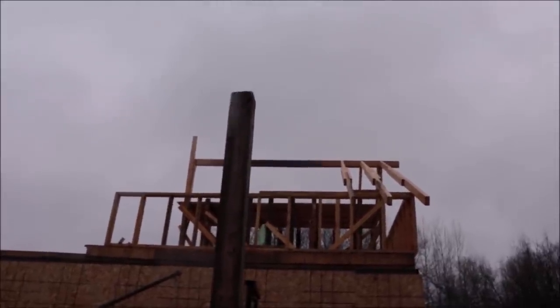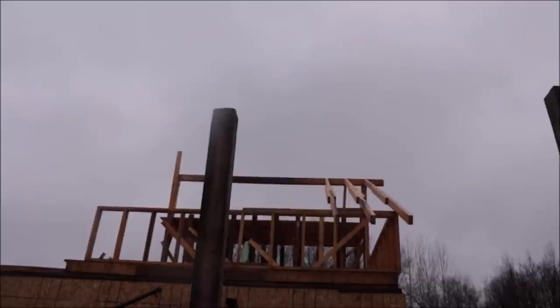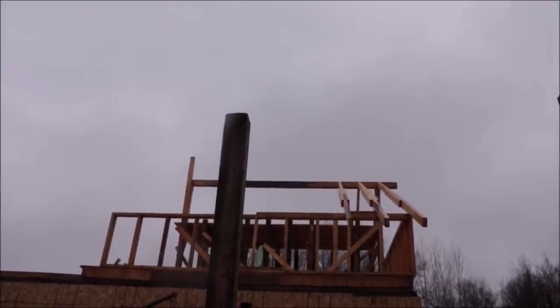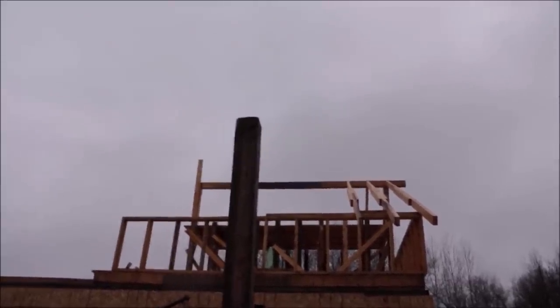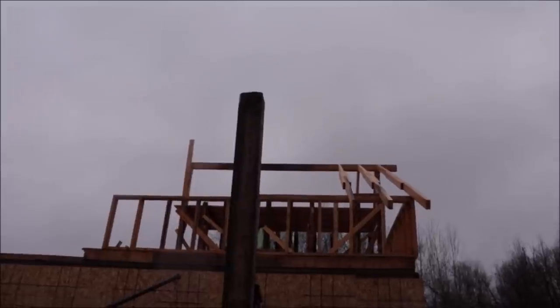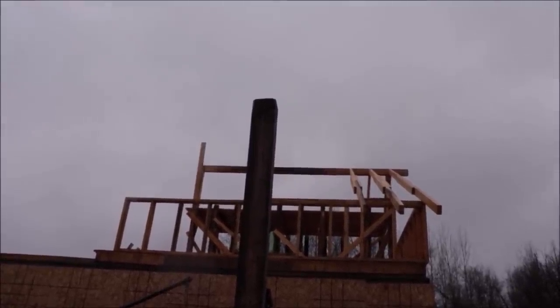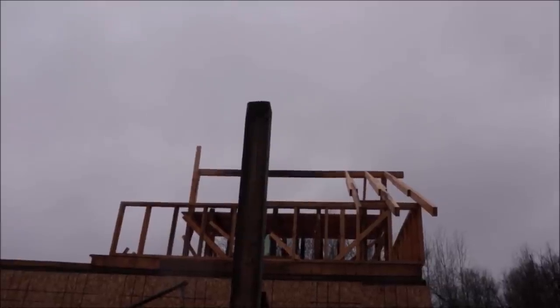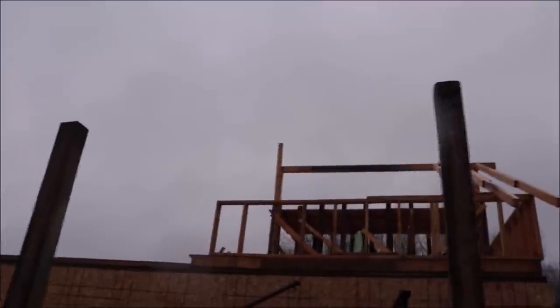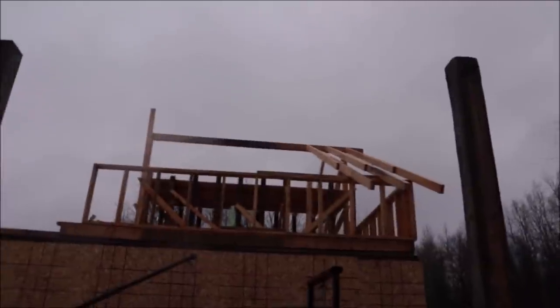From the roof to the top of that ridge beam up there is 14 feet, so I have to minus 6 inches off that, because there's going to be a 6-inch beam on top running this way across, sitting on top of those two posts, and that's where the building will sit. So one more rafter on the far side, stand those two beams up that we go get to mill, and once those are up, then we jump over here to this side, and we start putting up, I think, four more over here, and then we're done.